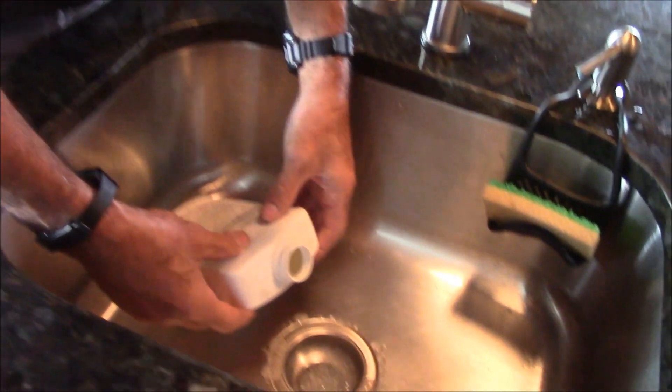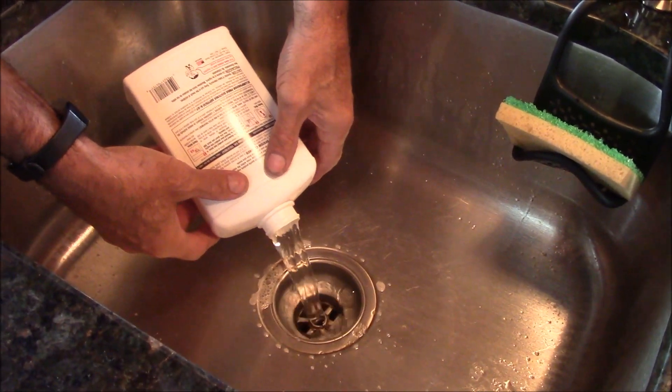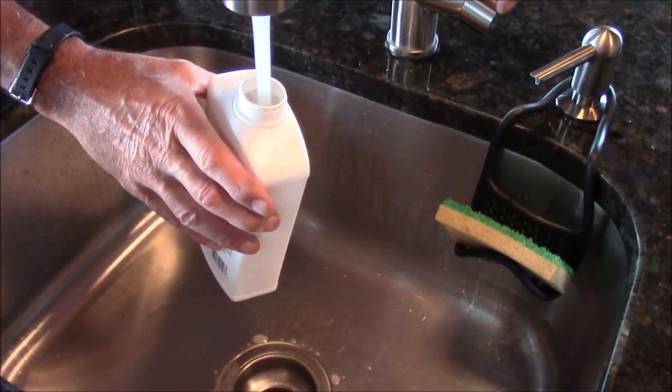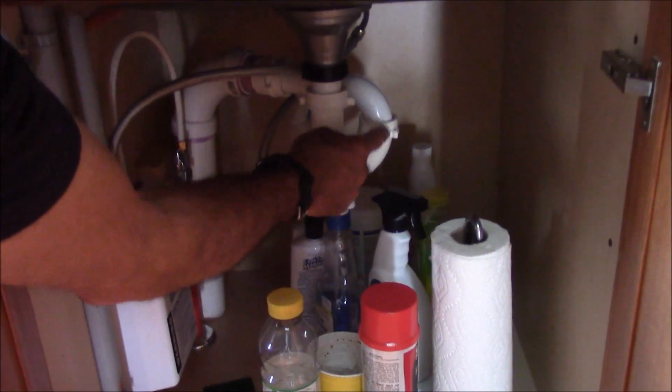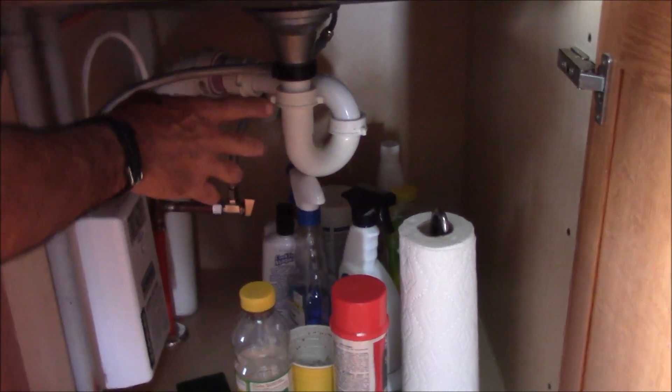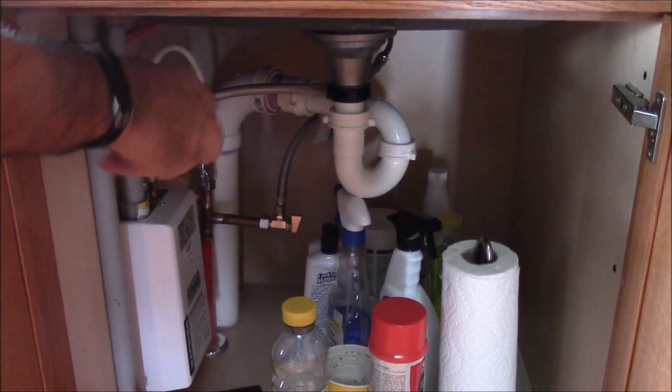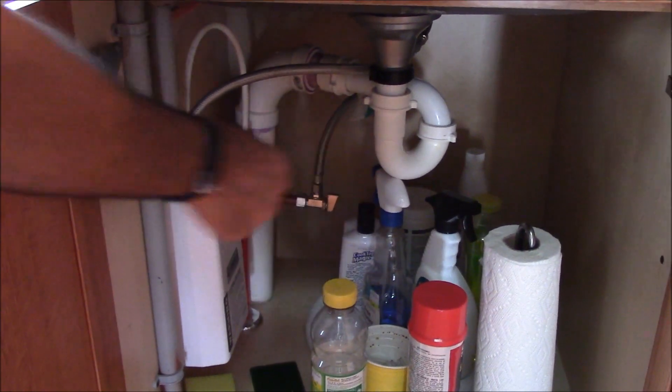So it's actually really easy to use. You take the product, you pour it all in the drain all at once. Now there's a trap in this sink so I'm going to fill this with warm, not hot water. This is going to push the product the same way I use drain cleaners. This trap is always holding say six to eight ounces of water, so when you put drain cleaner down the drain your drain cleaner is in the trap — it didn't go down the drain. So whenever you use drain cleaners or products like this through a sink that has a trap, always flush it with some warm water to push the product out of the trap and into the septic tank.